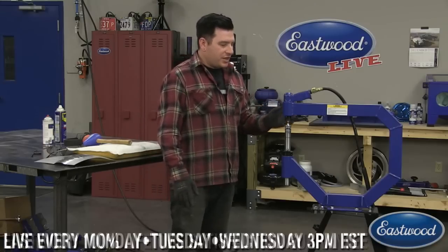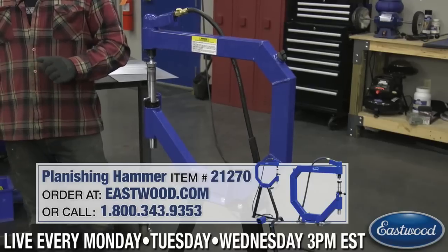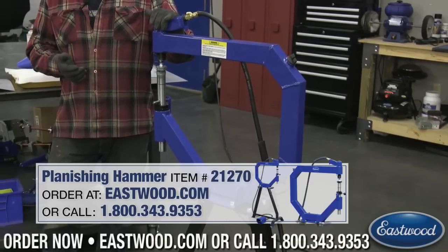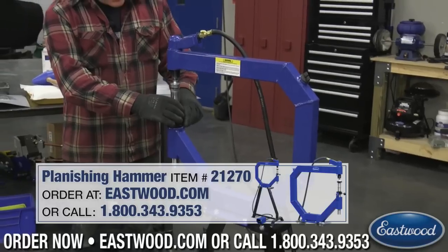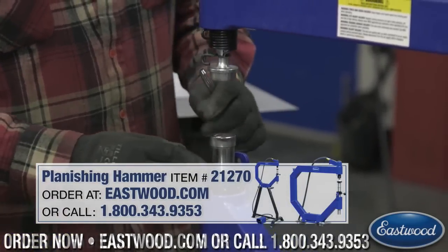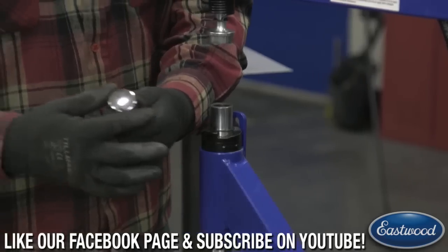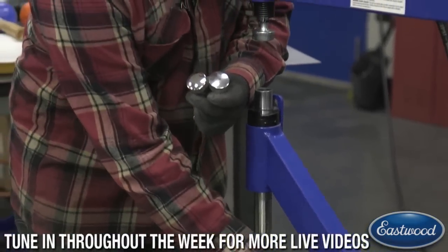The way a planishing hammer works, if you imagine when you're using a hammer and dolly, you have a dolly underneath and you're hammering and smoothing out an area. This does that way faster. On this, we'll get Joe to get in close here. We have a bottom tool holder, or die holder, and in that there are these lower dies.